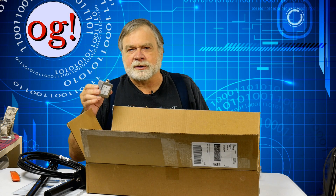Over here on the end is the power injection for that. This right here does have an LCD — it's the same kind of thing, but it's more like the MFJ in that it only provides the juice for the antenna preamp itself. It does not protect the antenna from transmitting. So this is the way the MFJ works — they call this a bias T. This puts 12 volts out where it can be used by the preamp. This is for receive only — you'd use this as a shortwave listener, or if your HF radio can use a different input for the receive-only antenna and another input for the transmit.